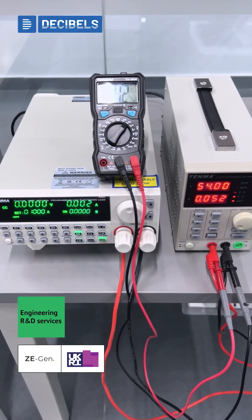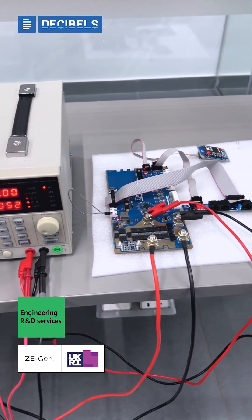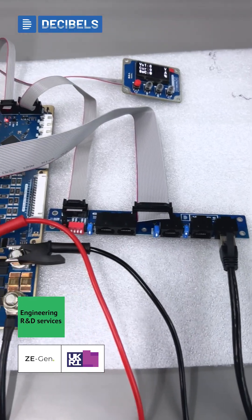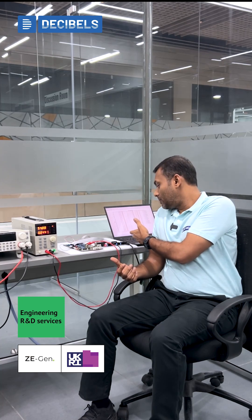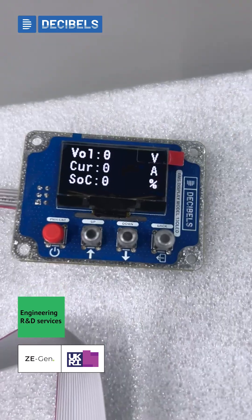As a part of the BMS, we have certain hardware components — the MCU, AFE, FET driver, EEPROM, watchdog, and various other hardware components. We also have external I/O interfaces as part of the hardware, including communication interfaces such as UART and CAN.